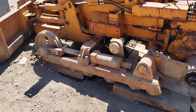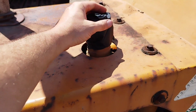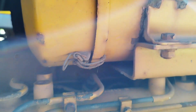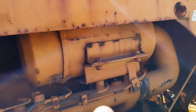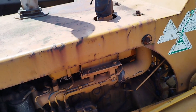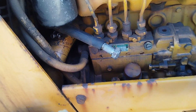So we've got a few bits done. I cut the pipe to put a new air filter top on. However, when I investigated a bit further, the actual air filter housing - the box in here - it's full of holes. So the whole box wants replacing, which isn't the end of the world. I've shortened these pipes down and capped them off out of the way - I need to do a bit of a better job of that.